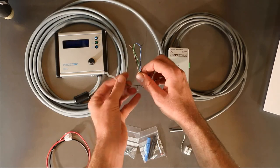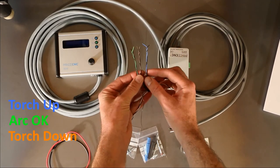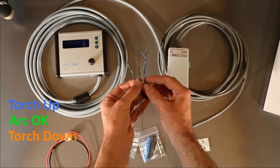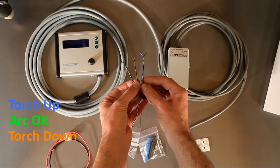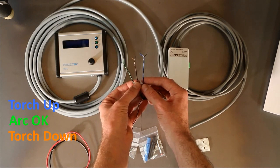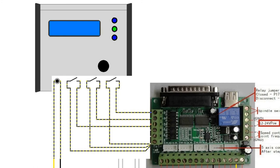The remaining three pairs are the up, down, and arc-ok signals. Green is arc-ok, brown is down, and blue is up. These signals are not polarity sensitive. They are normally open when the signal is not active. The solid state relay in the height controller closes and returns the signal to the breakout board. What this means is that in each of the three pairs, the breakout board supplies the current on one wire, and when the signal is active it returns back to the breakout board on the other wire in the pair — just as if the height controller was operating a simple switch for each signal. Most breakout boards are designed to work with volt-free or dry contact input signals, as this is the nature of the limit switches these inputs are usually intended for.